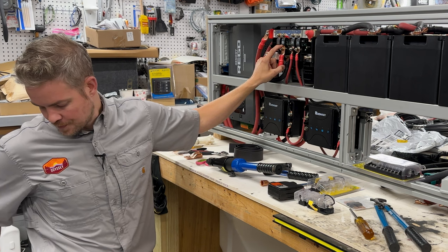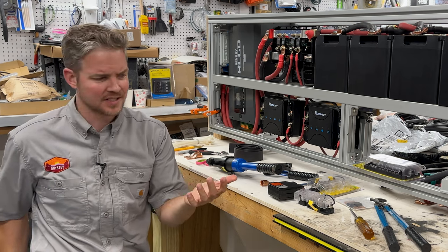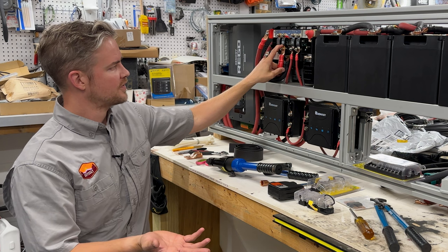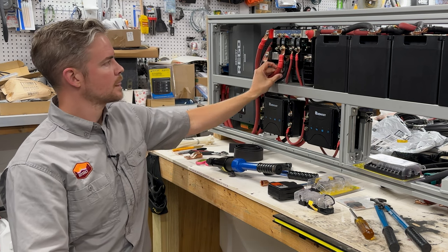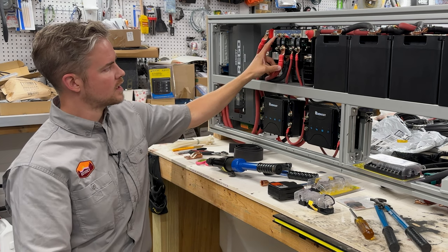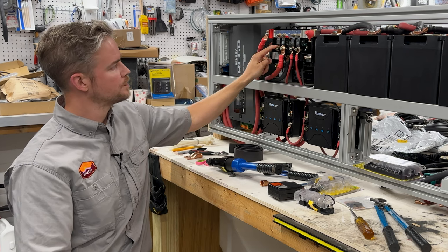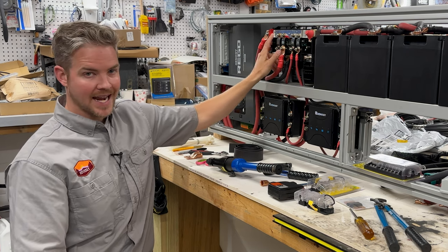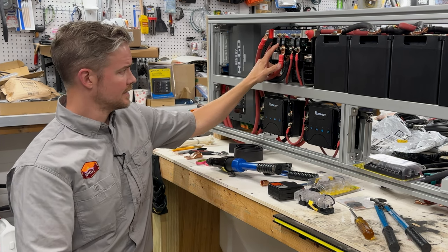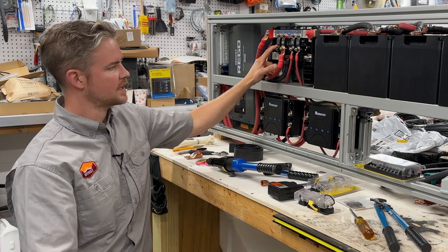And we have our 1,000 amp capacity, so don't forget that. From that 1,000, you can start ticking away at your reserves. After the 300, you get about 700 amps left. So where is that going to go? Next, we have our Dometic RTX 2000 rooftop AC unit. The manufacturer recommends an 80 amp fuse protecting that circuit. Just to do simple math, we bring it down 80, let's just say 100. So we got about 600 amps left.